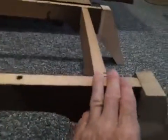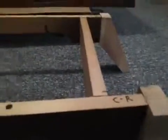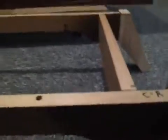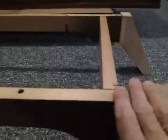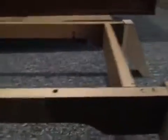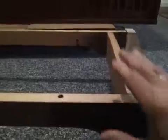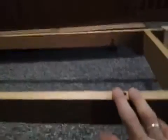And if you remember, I showed you the metal before. That metal will carry all the weight and transfer it to the legs. And hopefully there'll be just enough of the metal to make sure the stereo console won't bend in the middle from the weight. It'll kind of stiffen up. It'll set all the weight very evenly on these legs, and won't allow the legs or the stereo to start bending under the weight.